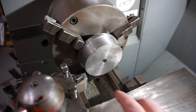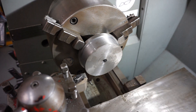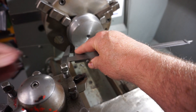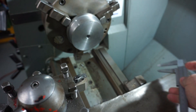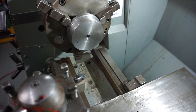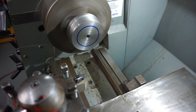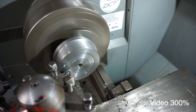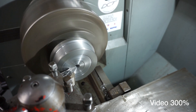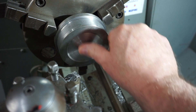What I'm going to do here is relieve it — I'm going to come in about half an inch and then relieve the material from here. This is an old trick my old buddy Pete taught me. He said you do that so it sits nicely on a flat surface. I'll just mark that half inch — and I know you shouldn't use verniers as a scriber, but they're really old so I don't care. So there's my half inch, roughly — this doesn't have to be too critical. I'll start the lathe up and we've just dished that out so it'll sit down flush. Happy with that.